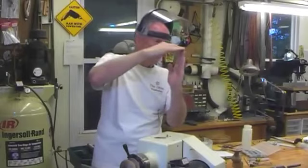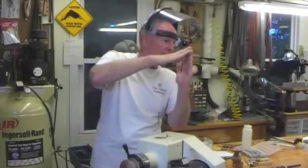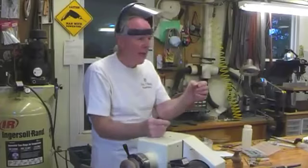What you're doing is, here's your ground surface, and here's the top of the machine tool. So you've got a nice corner there, and you can do some nice cutting. But once you grind that little flute in, you've made more of a cutting edge on it, so it takes a little bit less pressure. And once they get ground back, you just grind back a little bit. You can go as deep into that flute as you want.